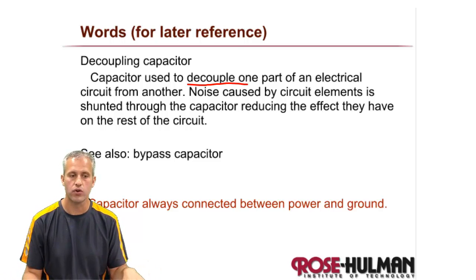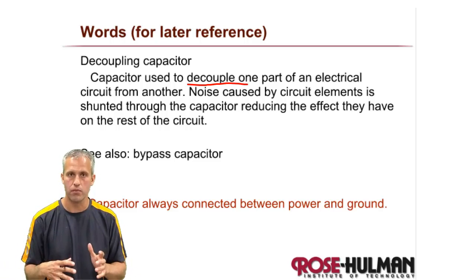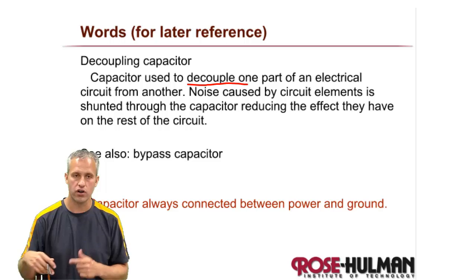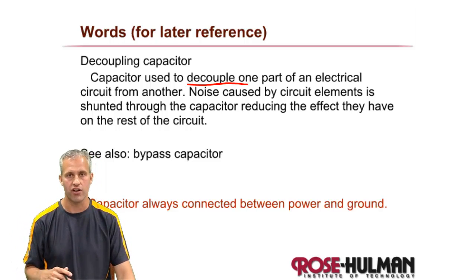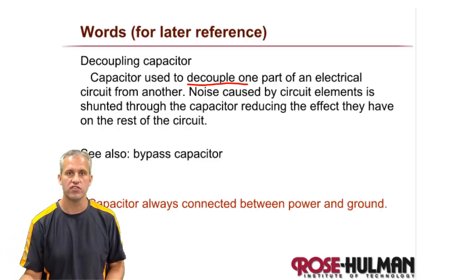The PIC really wants a nice, clean, quiet environment, but it has to be on the same breadboard as a motor, which when you turn it off still causes spikes. Even with the snubbers, nothing's perfect in electronics — they're still there. And you take as many levels of defense as you can against them.